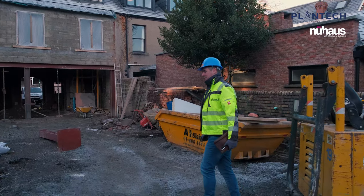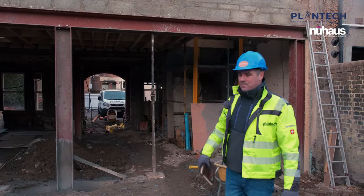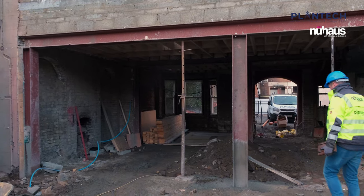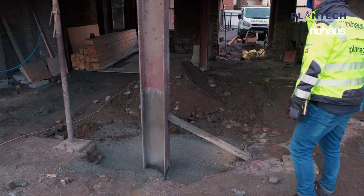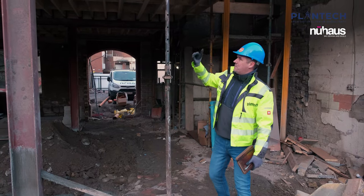Let's come on through and have a look in more detail. Here at the open plan back wall of the house you can clearly see the new steel beam goal post sections. We've also got a central column, and getting closer here you can also see the reinforced concrete base pad — to give you an idea of the extent of restructuring we had to implement. Just the whole back wall of the house partly had to be rebuilt.